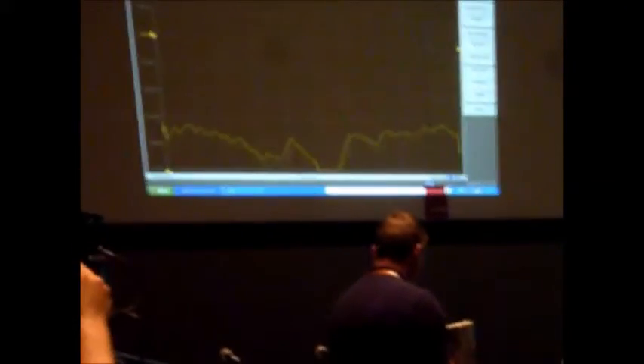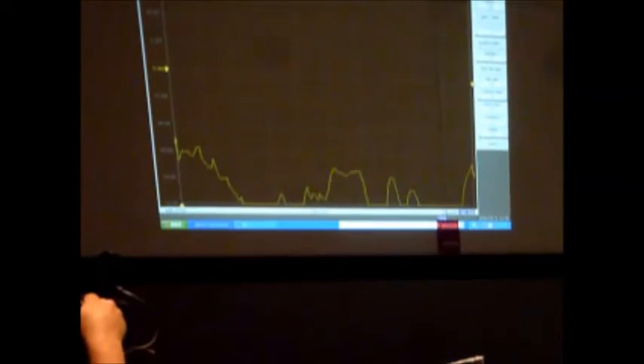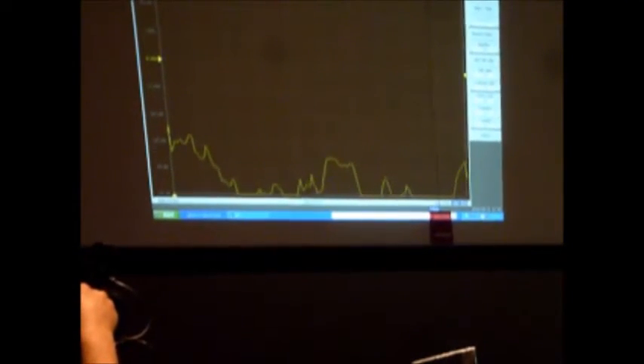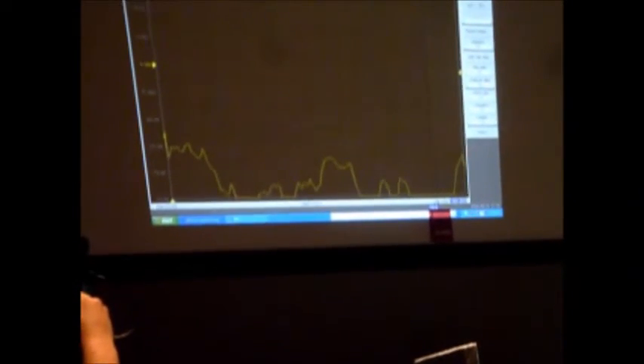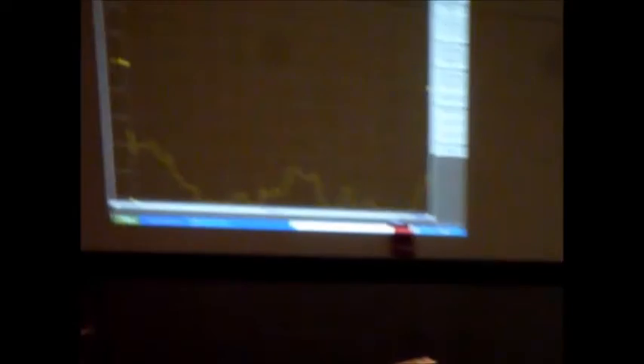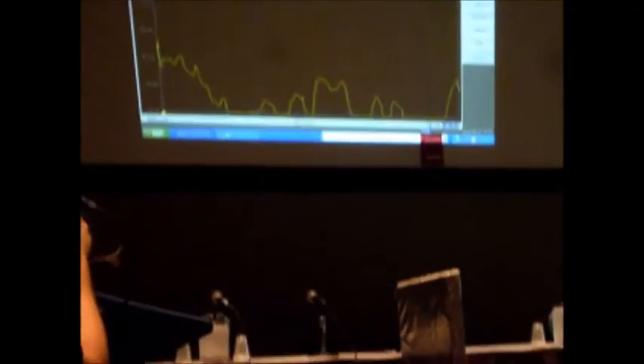This is just two layers of half-inch styrofoam with aluminum foil wrapped around it. It looks like a pretty good wall. Obviously there's a little bit of knife-edge diffraction, and a little bit of the beam over-illuminating the wall. That accounts for the fact that it's not down 50 dB, plus there are multipath reflections. But it looks pretty good — that's minus 15 dB down from the direct path, and at 2.5 to 2.6 GHz it's down about minus 20 to minus 25 dB.